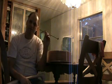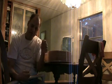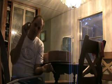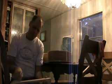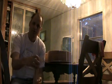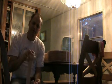This is just a piece of mild steel rod, which we've threaded here on this end, and then also cut a limited number of threads on this end, which go into this barrel bolt. Now, the way that this guitar was built by Gibson, they cut this trench all the way through and then counterbored a hole here in the end and put a screw in there, put a bolt in there to hold it fast, but it's got a kind of a narrow dovetail.